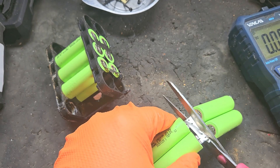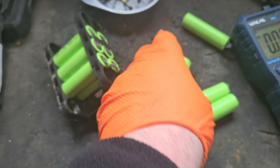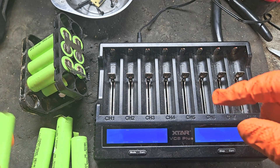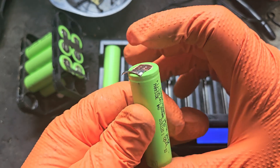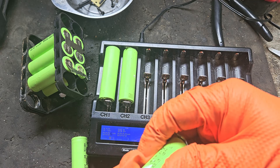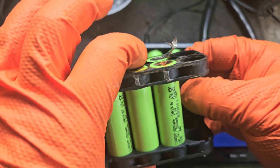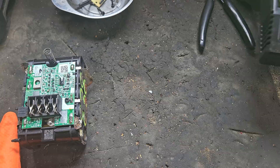I may have to charge these up a little bit — I'm thinking about the best way to do it. Believe it or not, scissors are a better tool for this — a good strong pair of scissors is your best friend with these old nickel strips. I'll separate these all out and charge them up on my single-cell charger. This is my Xtar VC8 Plus cell charger — it charges individual cells and shows you their resistance and health. I'll put a link in the description. The goal is to bring them all up to 3.83 volts.